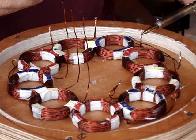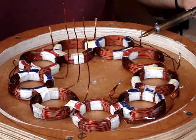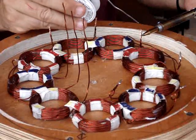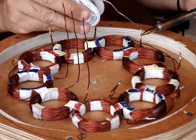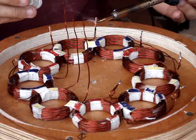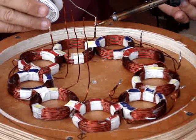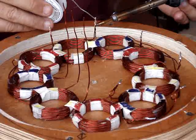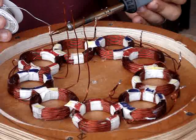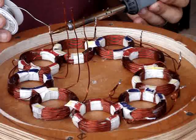Here's some information on how I got the size of the coils. The center of the coil is supposed to be the diameter of your magnets. The height of your coils should be half the width of the magnet diameter. That's how I came up with this size, but it also had to do with making it fit into the space available — taking all those criteria and coming up with the best size and shape needed.